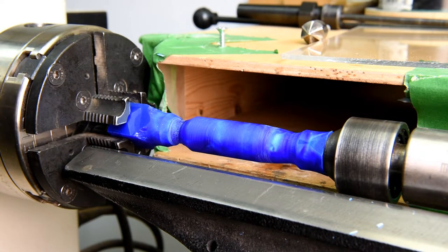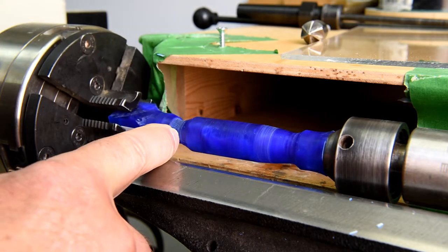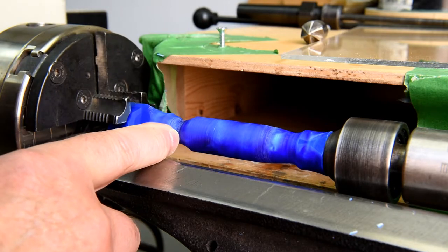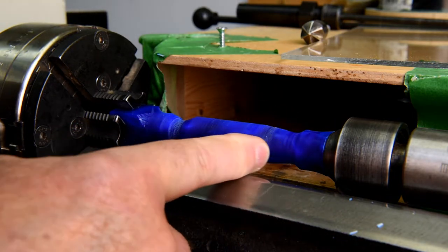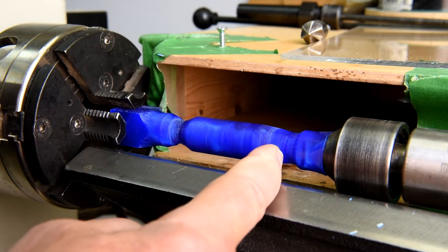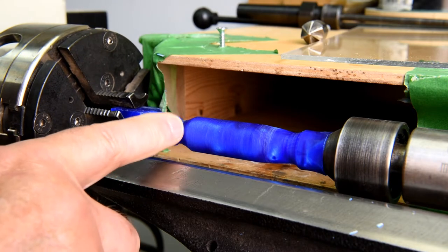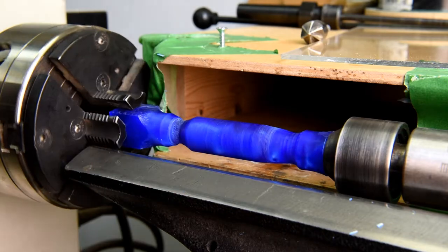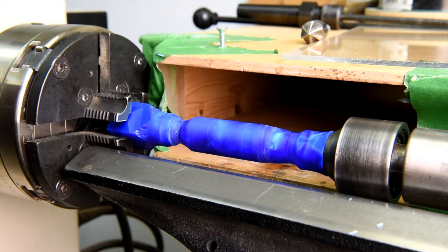I don't know if you can sense it or not, but I'm starting to get a little bit paranoid here with my parting tool. And I want to quit while I'm ahead. I'm at the point now where I can sand it down, get some sort of a little sheen going on there, and then later, with a saw, cut it in the right place here, and cut it off there, and then just sort of sand over the end so it's nice and smooth. At least, like I've said before, that's the plan.